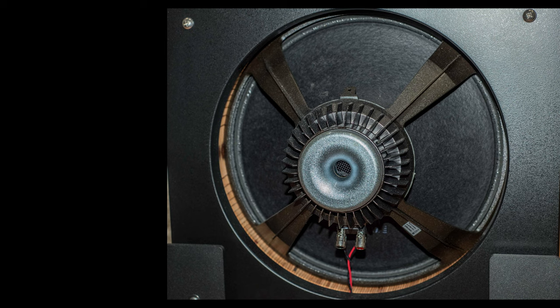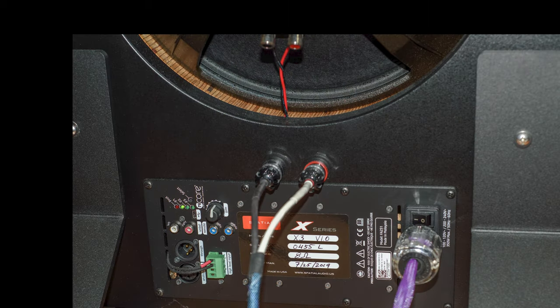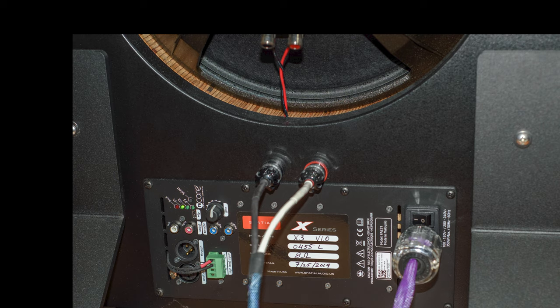When it comes to bass, those kinds of questions aren't really an issue. We use a real high-end Hypex N-Core power amp that drives the bass section, and I can't imagine somebody questioning how good that thing sounds for just bass use. So there's an opportunity to build a hybrid approach where the woofer is powered and then the mid-range and treble are passive — there's a passive crossover between the mid and the treble. You pick up a lot of advantages in terms of dynamics, speed, and control.